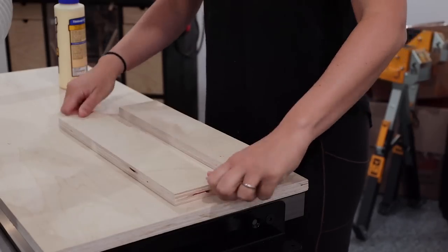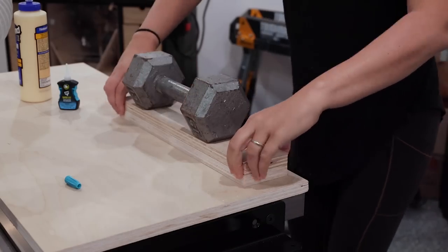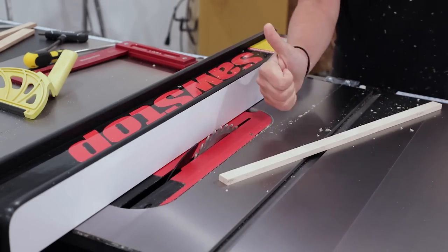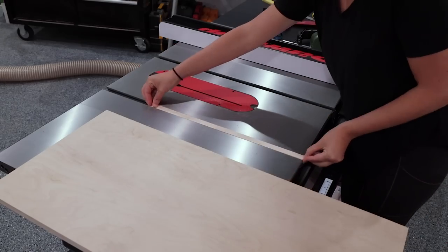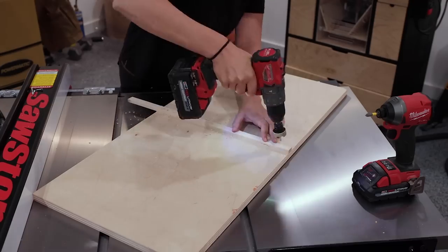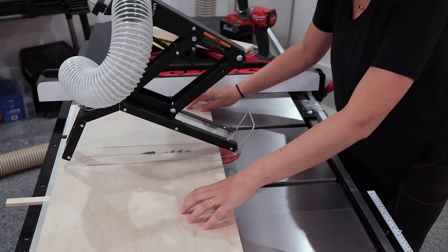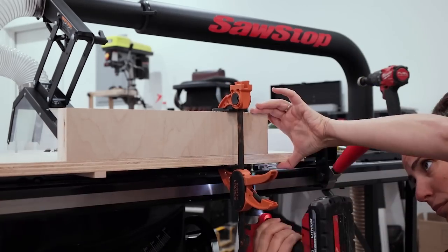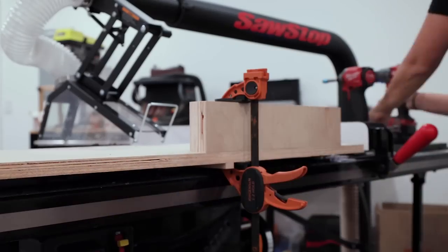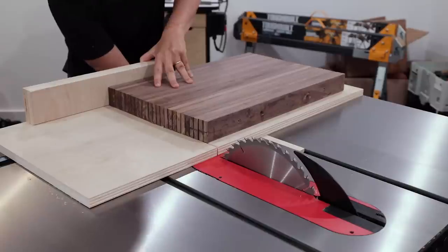But first I need a crosscut sled. Since I got a new saw I need all new jigs. I plan on building an ultimate crosscut sled soon, so this is just a temporary no-frills sled I slopped together in about 10 minutes. I glued two pieces of plywood for the fence, cut a strip of maple the same thickness as the saw's miter slots for the runner, used popsicle sticks to lift it off the bottom of the miter slot and put CA glue on it to temporarily stick to the sled base. I flipped the base over and permanently secured the runner with countersunk screws, made a kerf cut, attached the fence with one screw, placed a metal ruler in the kerf to pivot the fence square, then locked it down with countersunk screws.